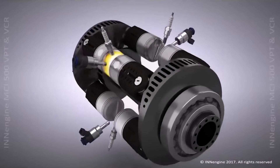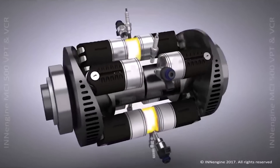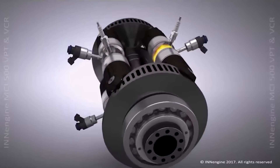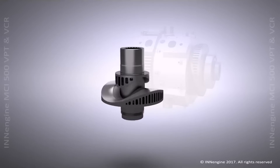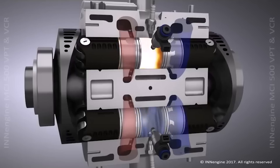The first thing you'll probably notice is that the pistons are arranged very differently to a standard vehicle engine, and that they push away from each other. This is called an opposed piston design. Also, the back of the pistons push on a wavy plate at either end, known as a swash plate, in turn causing it to rotate.